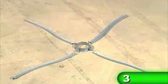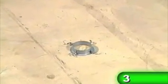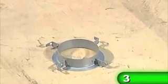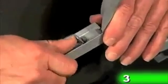To begin pre-assembly, lay these components out on a table or other flat surface. The utility circle is ringed with 4 clips that connect with the modified cross tees. These clips operate just like main tee splices. Insert the tab through the slot at the end of each modified cross tee. Then butt the components together snugly and bend down the tab for a tight connection.